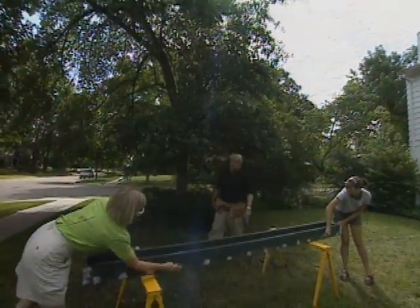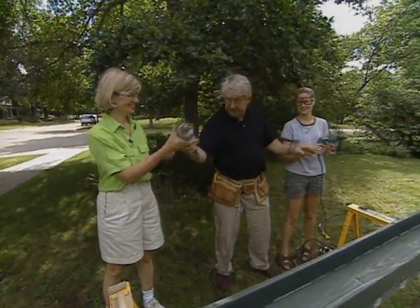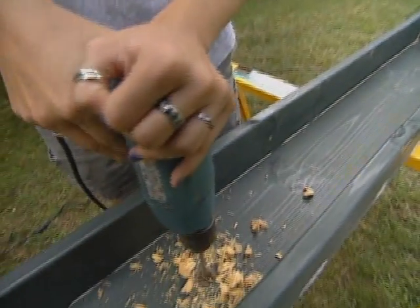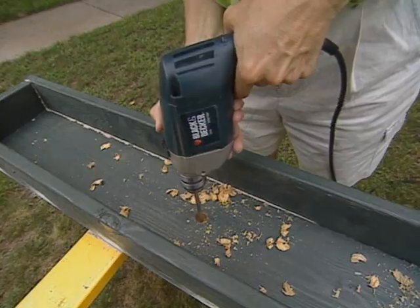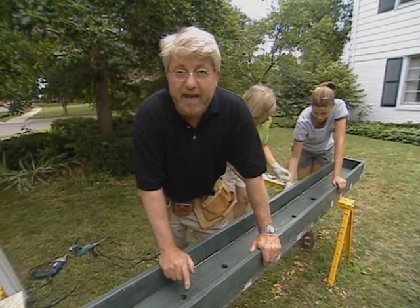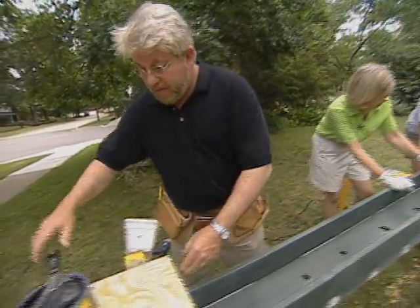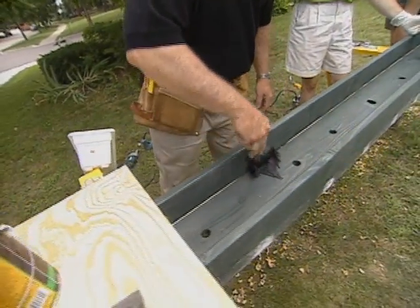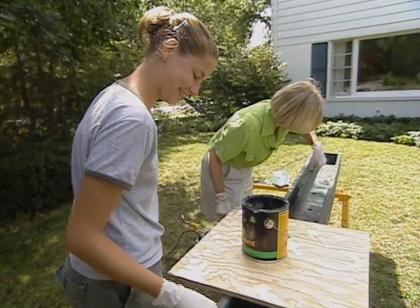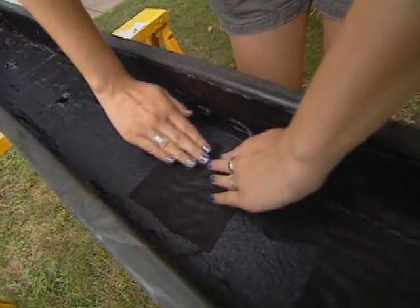What a beautiful morning to install a flower box! First, we drill some drainage holes in the bottom of the box. Now, this window box is going to be filled with wet soil for maybe years, so I don't trust the pressure treatment alone to keep it from rotting. We need something else — I could use a plastic liner, but I couldn't find one to fit. So another alternative is roofing compound, which you can buy at any home improvement center. You simply apply it with a wide putty knife, just like frosting a cake. Next, we place small squares of weed cloth over the drainage holes to prevent soil from washing out.